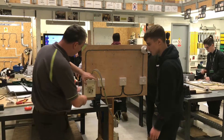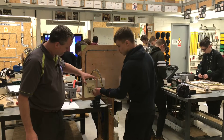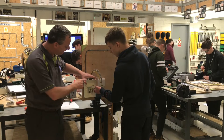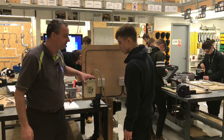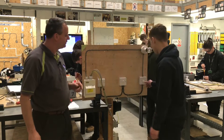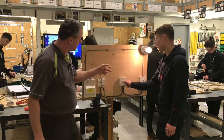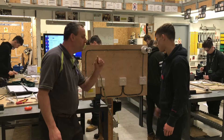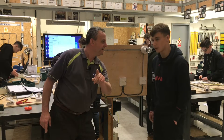Turn on the RCCB first — you're proving it works. How often do you need to press the test button in the installation? Every six months. Turn on the breaker. Let's try a switch — it works. Next switch. Next switch. Which test is this called? Nice and clearly for the camera: functional test.